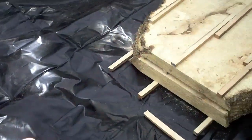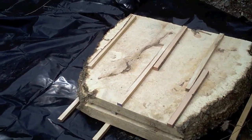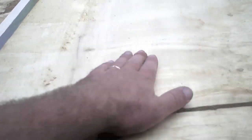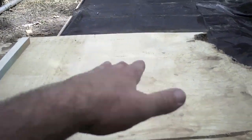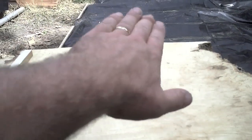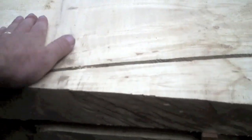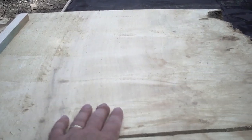For the next couple of hours I just keep stacking. As you stack, it's really important to try to keep them level. When you run into boards that have a saw blade swale — where a dull blade dove and came up — you want to space it a little wider and put something square across the top. It doesn't matter if short ones tip slightly, just as long as they form a level plane between one layer and the next.